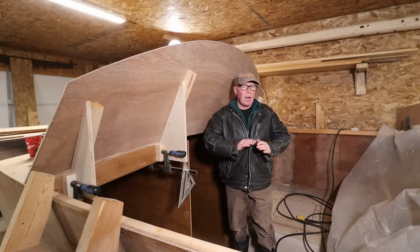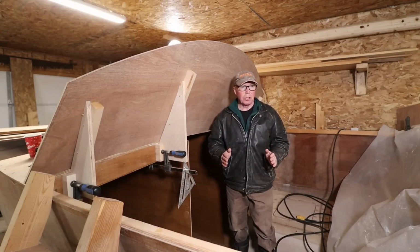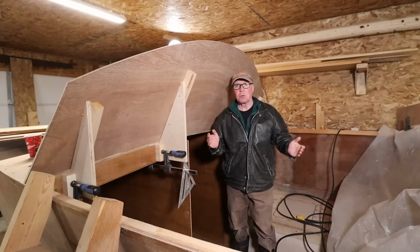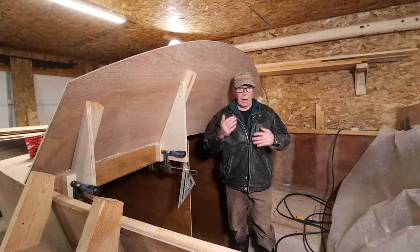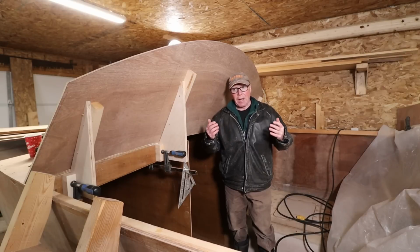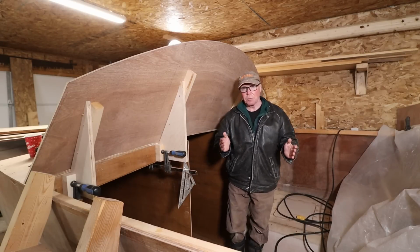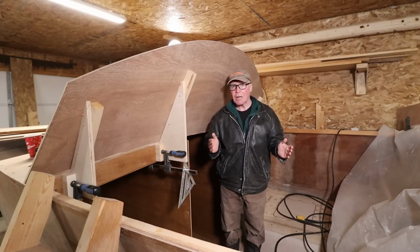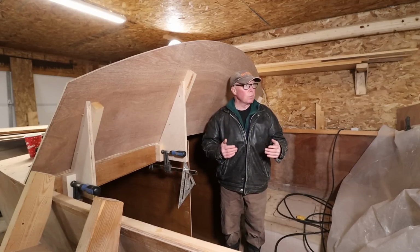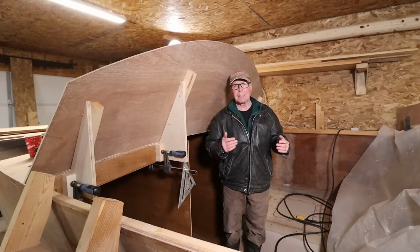but that's fine, because I know from experience on small boats, when you're on the ocean, you are never standing upright. You are sitting down and holding on. Hence the reason, when I came up with this concept and I was talking to the architect, I said, I'm very happy to have sitting headroom throughout. And he was delighted with that, because if you want standing headroom on the boat and you want that boat to perform well, you just need to go somewhere around 26 to 28 feet to get that.